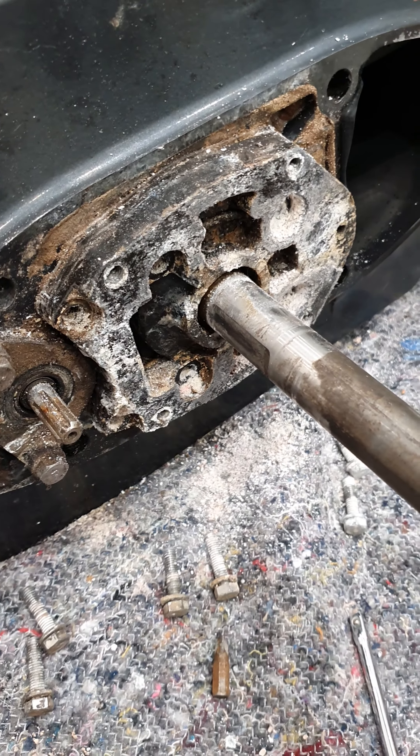What a lot of people and the manual advise, especially operating in salt water but good practice in fresh water as well, is to use gasket sealant in addition to what comes in these kits. You can see this is the gasket seal on the other side of the impeller, but it's best practice to apply some sealant on a surface like that. Equally, on the inside of the impeller housing, a good bit of practice to prevent any scoring is to apply some marine grease to the insides of the impeller housing as well.